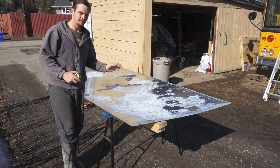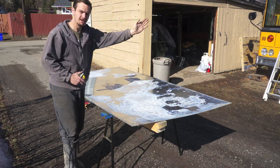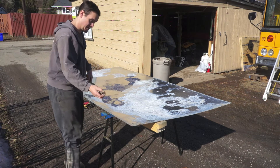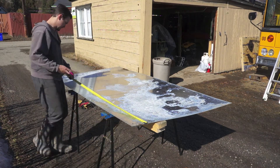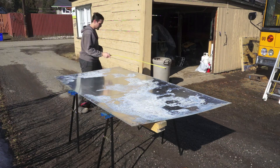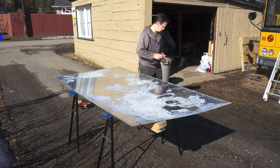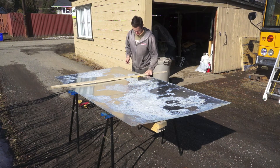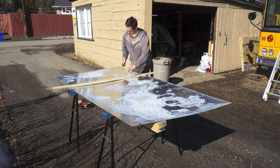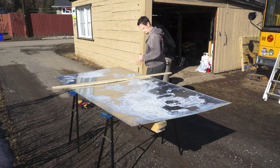There's going to be a bit of an arc so I'll figure that out up there. I measured from the center of my support steel at the top of the bus to the left and then from center over to the right — I had 32 inches on either side, which should cover everything nicely. So 32 times 2 is 64. I'll make a mark on either side of the sheet and then grab a straight edge or a level. I just found this piece of 1x3 — it's straight. Line that up with my two marks, got a nice line. Now I'm ready to cut.